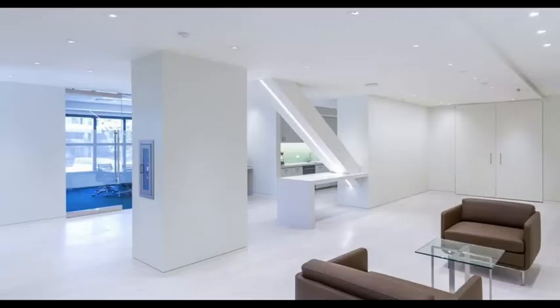I also do want to mention we offer a range of lens options, effects devices, honeycomb louvers to help you control that glare in the field, as well as optics ranging from 20 to 60-degree beam distribution in this product family. This is just another install photo of our 2 series square fixed downlight.